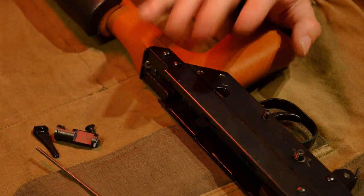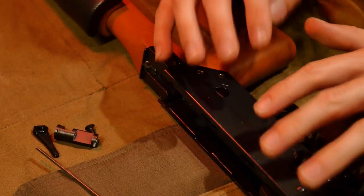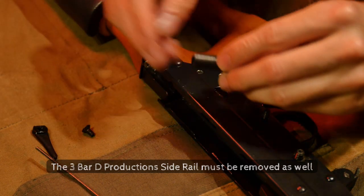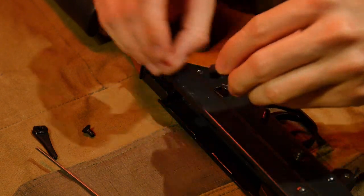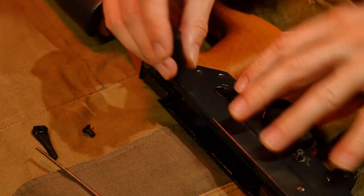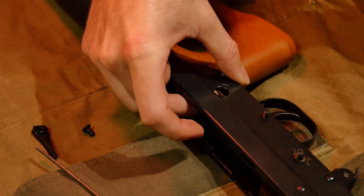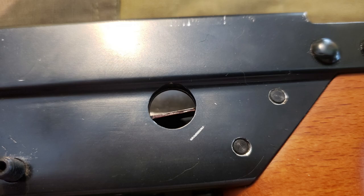As for your firearm, you'll want to have it stripped down to a basic field disassembly — the only thing left inside the receiver should be your fire control group with pins and the safety plate. You're going to insert the toggle cam with the skinny side first — not the fat head side — through what would be the left side of your receiver if you're looking down the sights, which is basically the same side the rail goes on. To insert it, you'll have to press down the spring tab on your safety plate so it doesn't obstruct the big window on the side of the receiver.